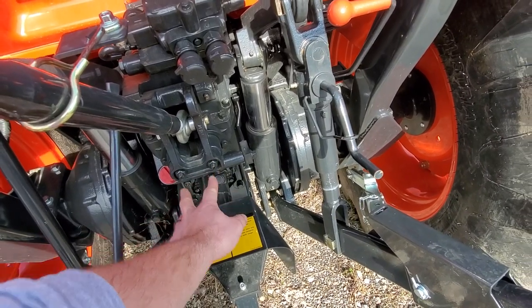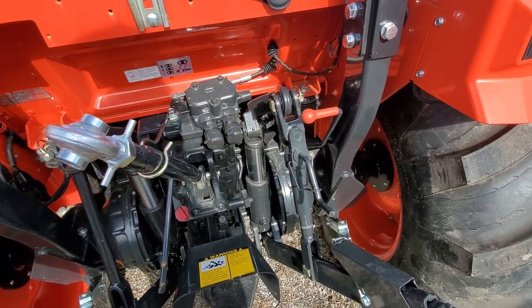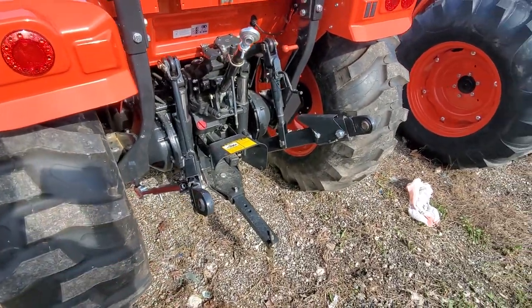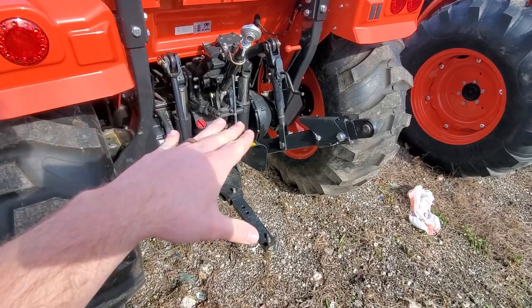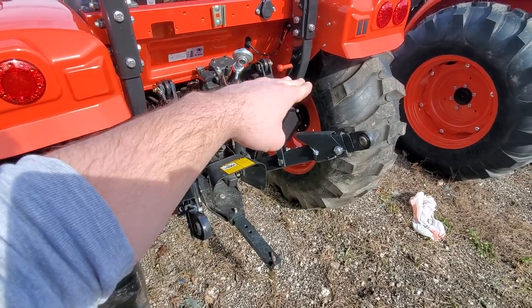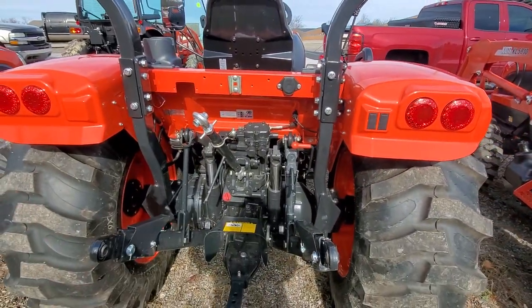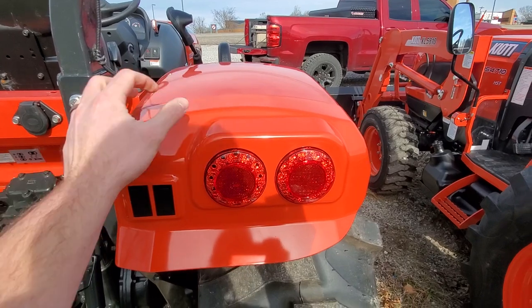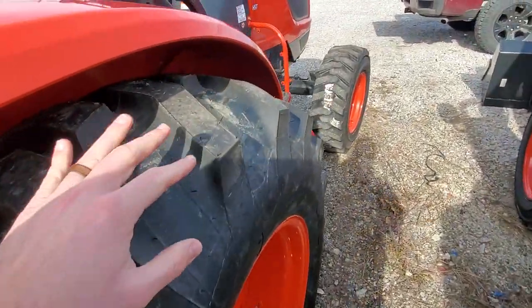You've got draft control — pressure sensing draft control. That's something used on ground engaging implements. Not very many people plow like they used to, but if you need something going under the ground like a plow or a tiller and you want to keep a certain level, draft control is your friend. It doesn't allow the implement to float up and down — it keeps it at a level under grade. The actual size of the rear end is bigger, with different fenders. The DK isn't going to give you this nice replaceable fender piece — it's a solid fender — but both are on the same tire.